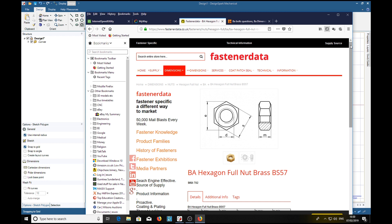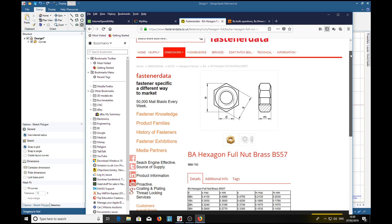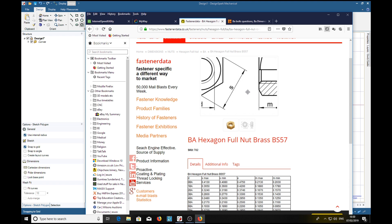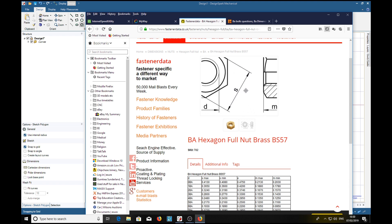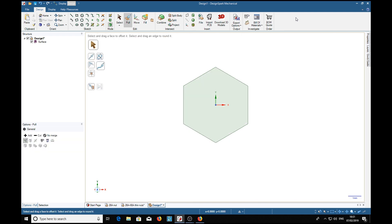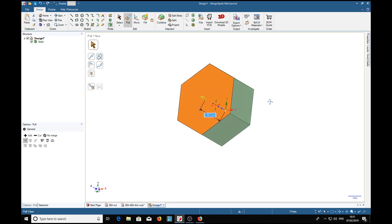This information is in fastener data — it's got a handy little picture for us, and the M dimension is what we want. We can also check across the flats to see if it's the same as what I've got on my sheet. The M dimension for 6BA — we'll take the max dimension — is 0.105. Across the flats it's 0.193, which is exactly the same as what I've got on my sheet, so that's good. We type IN for inches and return — there's our basic piece of material.